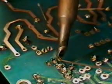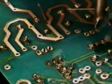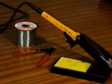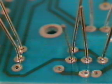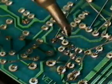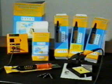As with most things, good technique will only be gained with practice. It's not difficult to produce reliable joints time after time if you just remember these basic points: use the right tools and solder for the job; make sure all of the metal surfaces are shiny and clean before you start; don't be afraid to use plenty of heat, but do it quickly, although you must wait for the solder to flow before removing the iron. And finally, don't forget that a complete range of soldering irons and accessories are available from Maplin MPS.